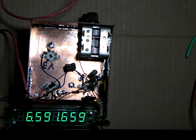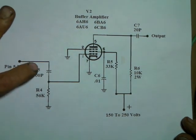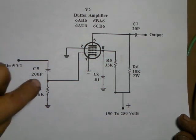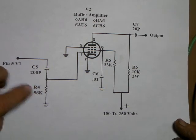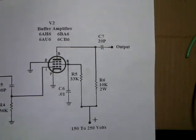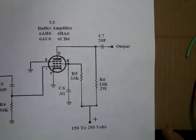Next video, let's see, find the right schematic. What's the next one? There it is. Okay. It'll be the buffer circuit. This is that C5 that we talked about, and pin 5 of the V1, the oscillator. Since it's already hooked, when we come back, all we're going to do is start right here with this resistor. That's the next part of the circuit. This is a little buffer amplifier that raises our output enough and isolates us from the oscillator, so any sample we take won't make the oscillator drift off frequency very far.